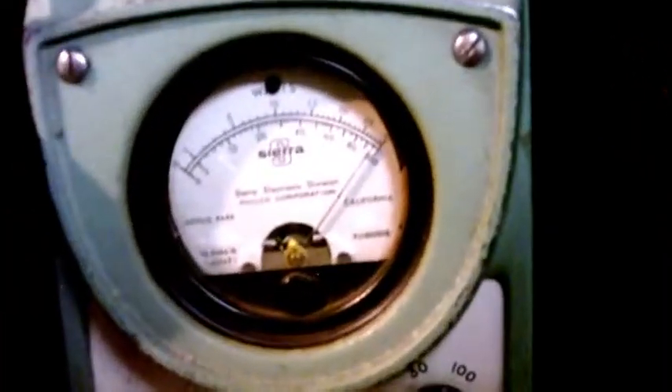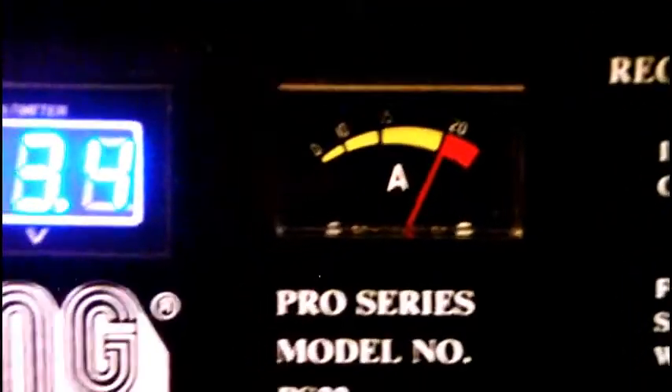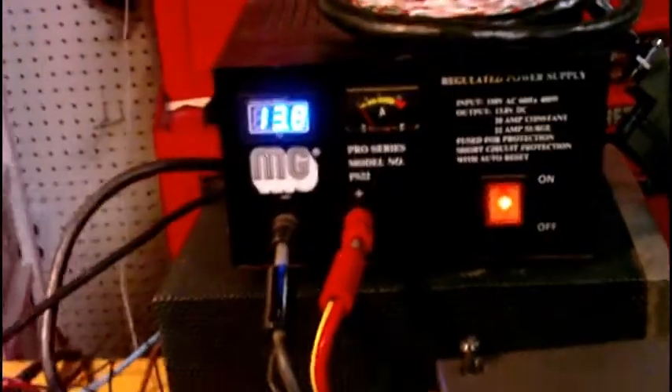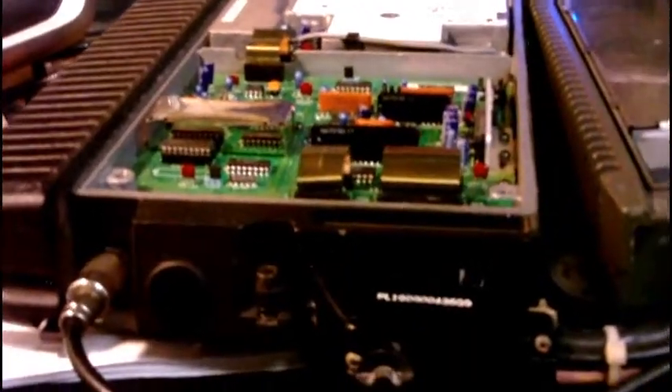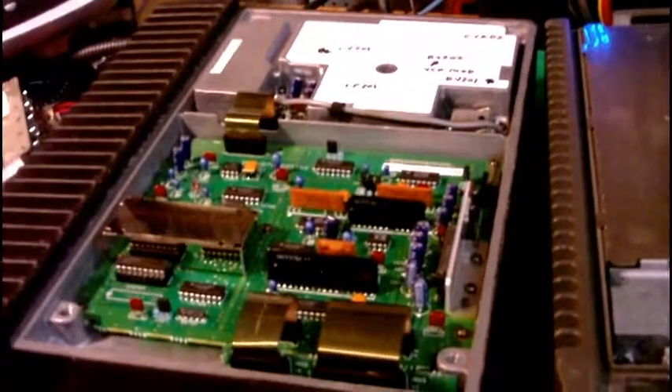The idea is that if the frequency was in use by another agency — another police department — you'd hear them on the frequency and know to stand by. They used to do frequency sharing in the commercial bands before trunking. It's hooked up to the dummy load — there's your hundred watts, and I could probably get more out of it. On the amp meter I'm getting a solid 20-amp load, dropping the regulator about half a volt — that's the limit of what this power supply can do.